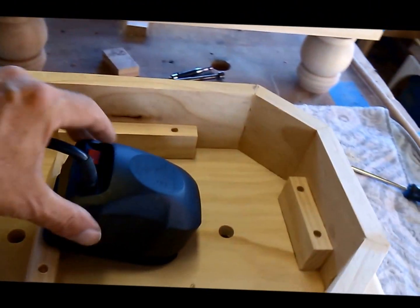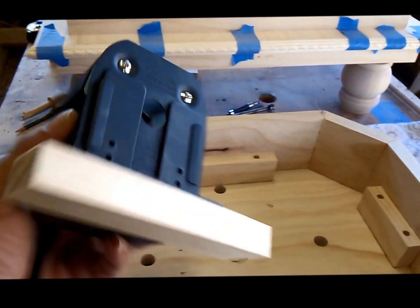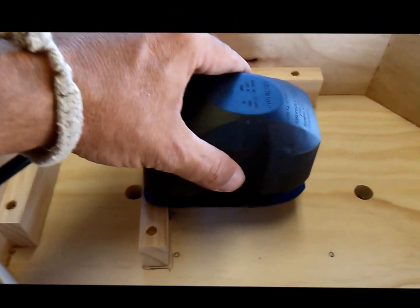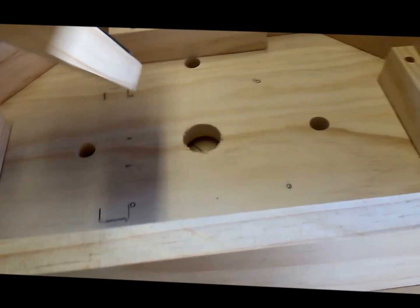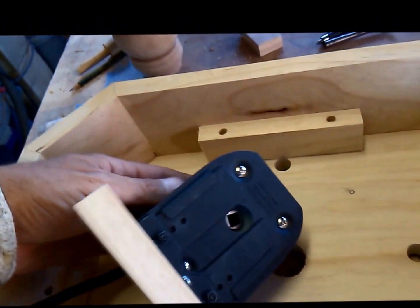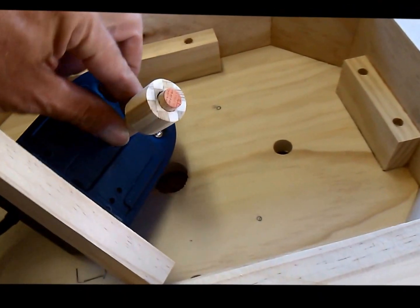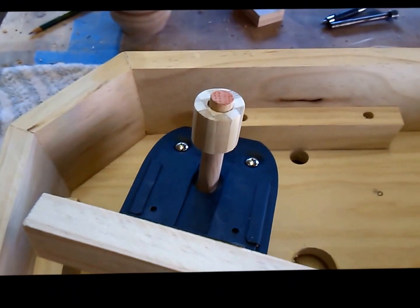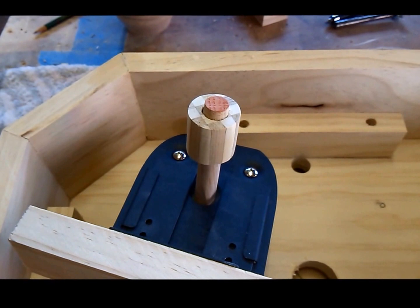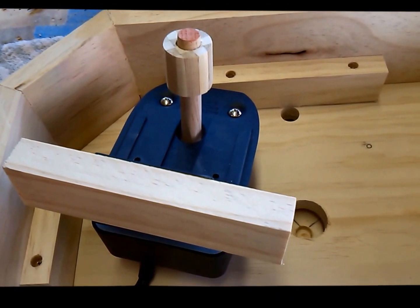The moment of truth is coming up soon. What I've done is I've taken the motor, I've mounted it to a bracket. What I'm going to do is I'm going to test fit it. I'm going to screw it in without gluing it yet. Obviously I've got to put the drive shaft. Here's my drive shaft. It'll get inserted down in here. I'm not going to glue that yet either. I want to test it all first. So we'll dry fit it. We'll dry fit mounting the motor. We'll give it a shot. If it works, we'll glue it all down. It's dry fitted.